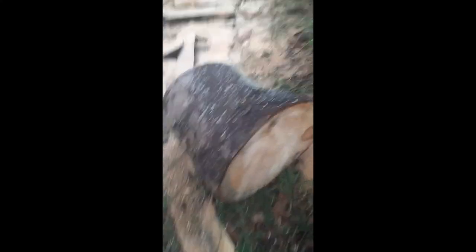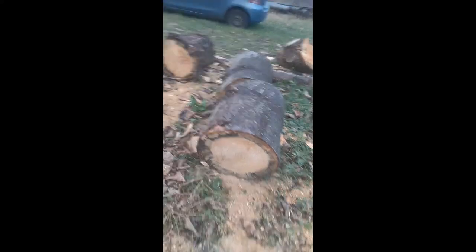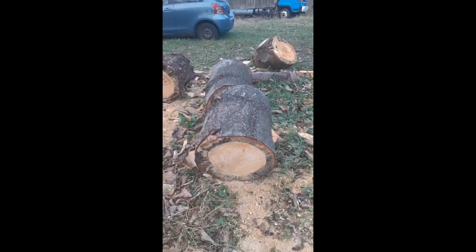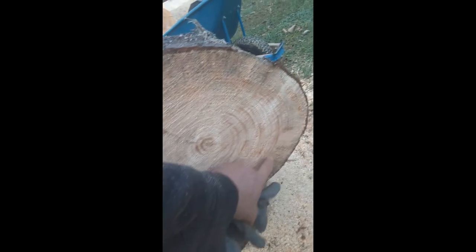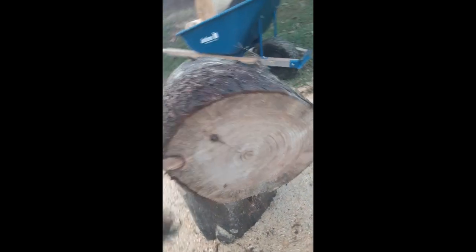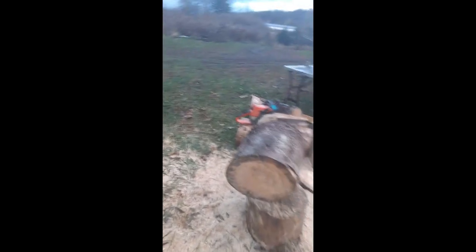This is what's going to happen to that sapwood if I don't get rid of it soon — if I leave it out here with the bark on it in the weather, it's going to keep feeding that decay. I had this up off the ground all summer but it was an older sick tree to begin with — there are some holes in it. On this cross section, I want to get rid of pretty much all of that outer part because it's already soft. It's carvable but it's going to crack really bad when it dries out, so get rid of it — stop feeding that rot.